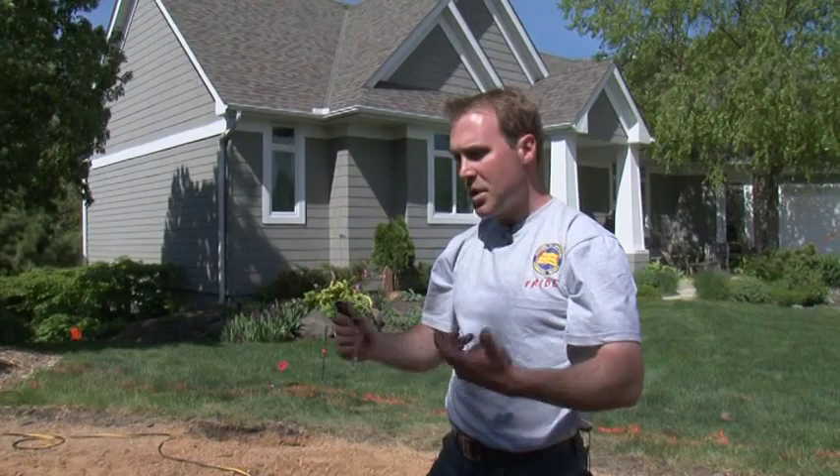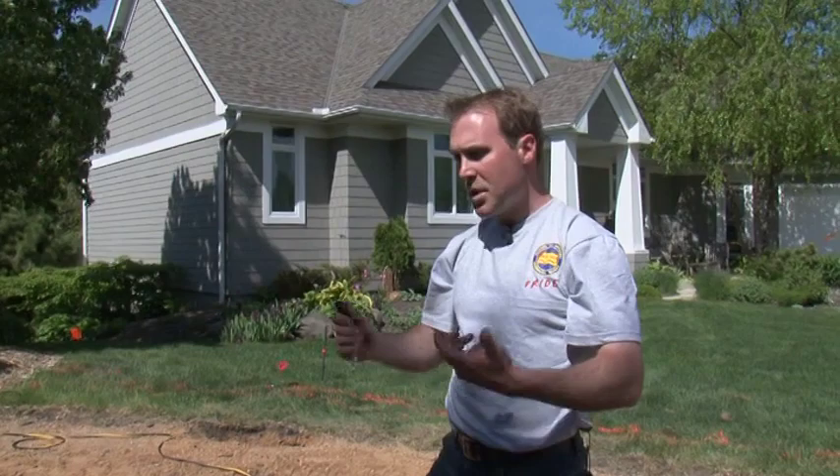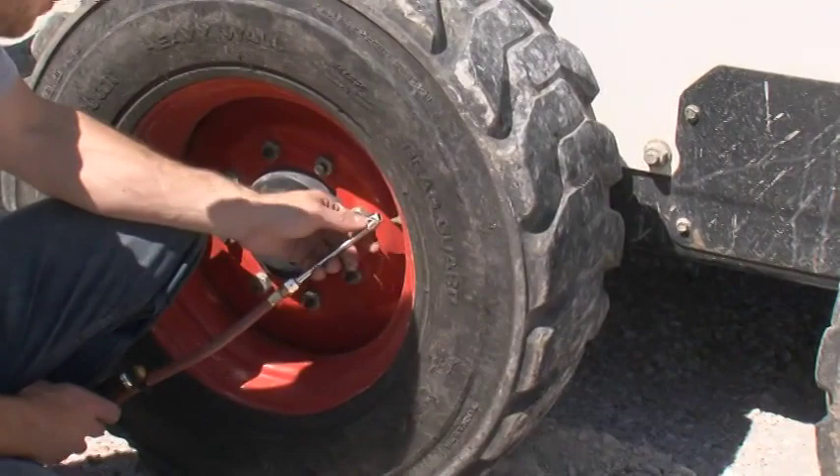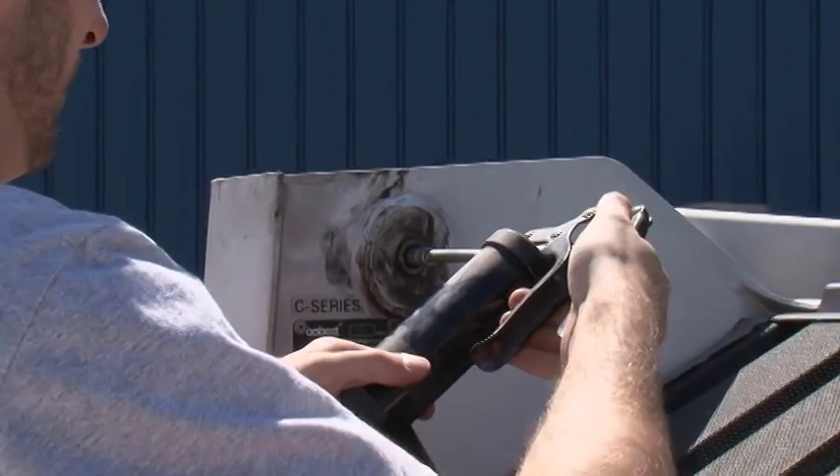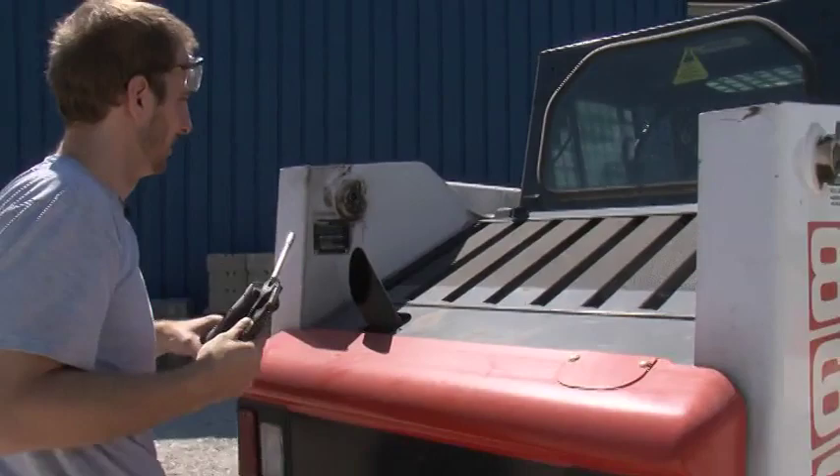As far as maintenance goes to really speed things up with the bobcat or skid steer, maintain maximum air pressure in all four tires. If it's off by five PSI on one tire, it doesn't grade properly and it adds possibly hours to the excavation and base installation. It's also important at the start of every day to make sure all the pins are fully greased for smooth operation and to reduce wear, and to check the engine oil and hydraulic fluid levels.